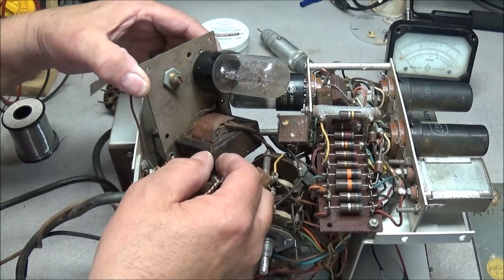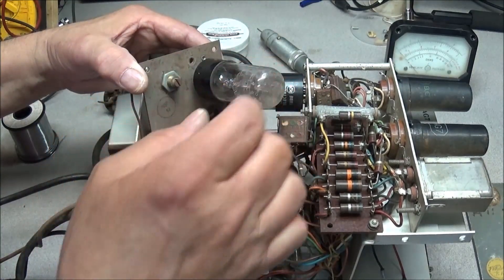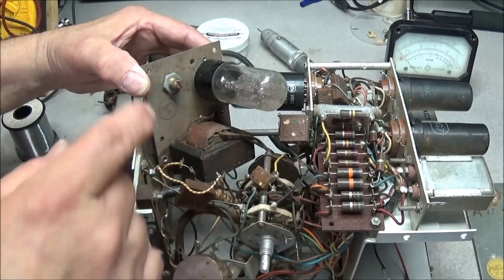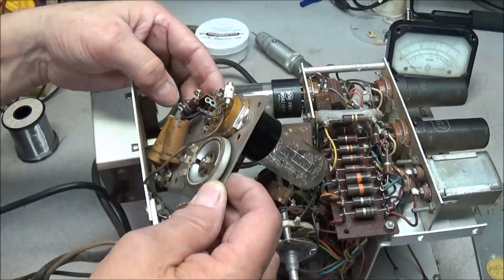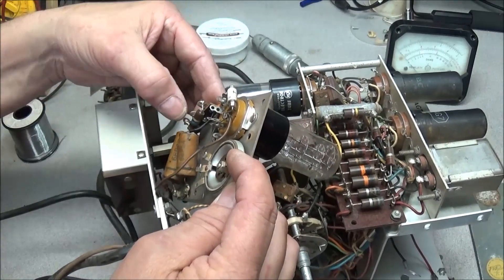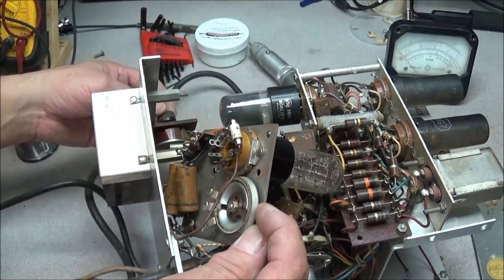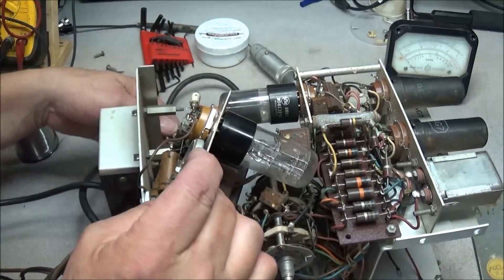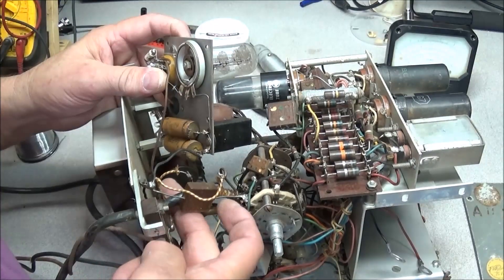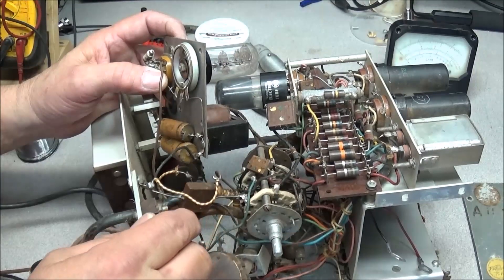Here's a better view of that little metal plate I mentioned that I cannot find on the schematic. You can see a transformer, a potentiometer, and it does say '6-4' on the tube. Hewlett Packard is very good about putting tube numbers on the chassis everywhere a tube is used. There's a big wire-wound potentiometer, what looks like a diode on the bottom of the tube, one resistor, two capacitors, and one wire that runs around to an adjustment on the back of the unit, with a couple of leads going to ground and the two transformer leads going up into the unit.